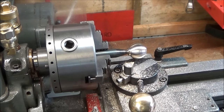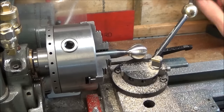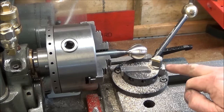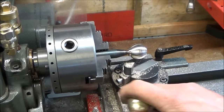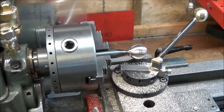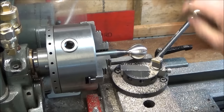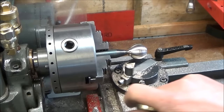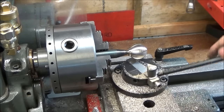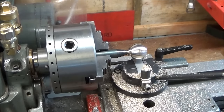And that's the ball finished turned. So I'm very pleased with the upgrades on this tool. And if you think about it, you can actually make a new centerpiece like this and adapt this for any lathe really by adjusting your center height. And to make this run really smooth, I use molybdenum disulfide paste on the contact surfaces, and it runs really smooth and it's a really lovely strong tool.